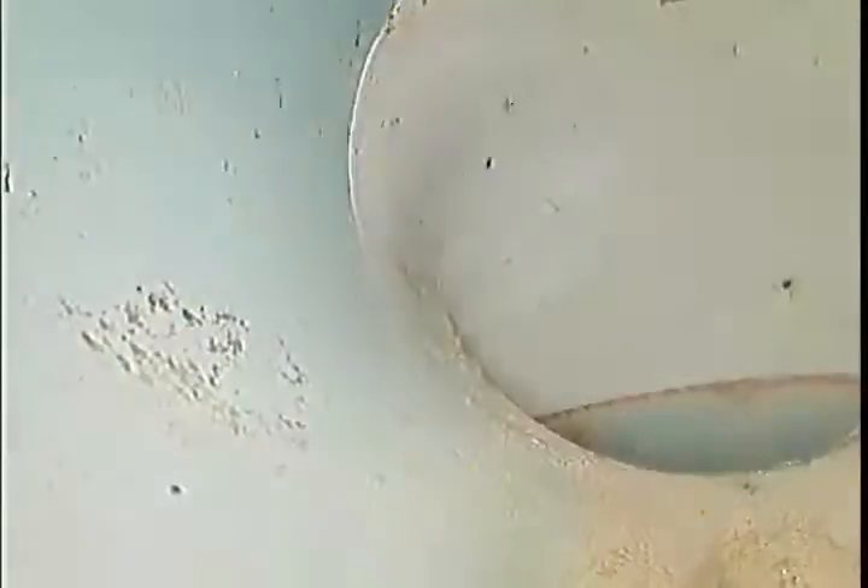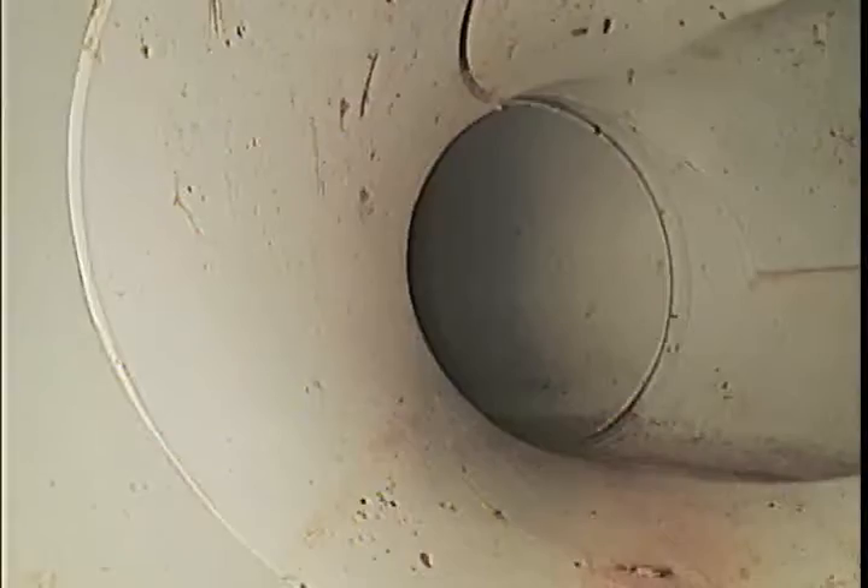All right, go back to zero — give us an idea. Straight away you can see it's dropping back in there, then into another 90 — so that's two 90s. There's a Y-junction here, maybe picking up the other sewer or something; one pipe going in.